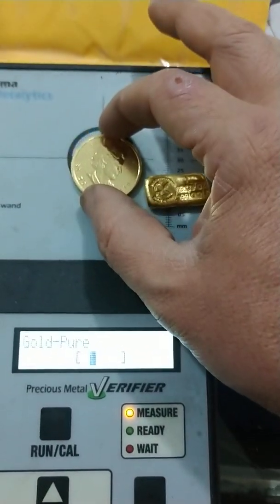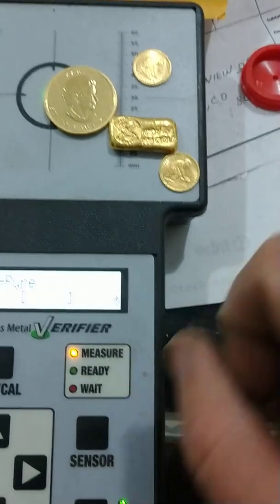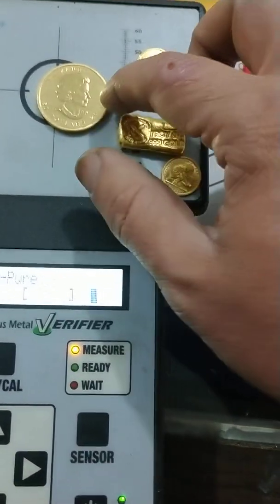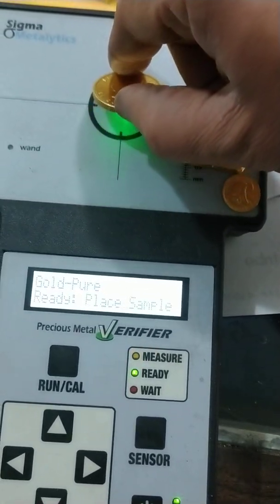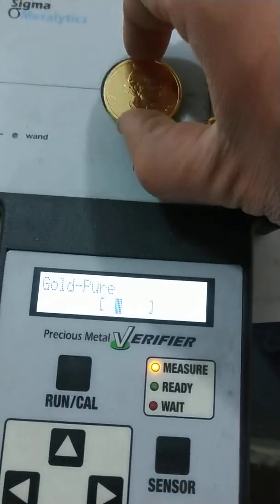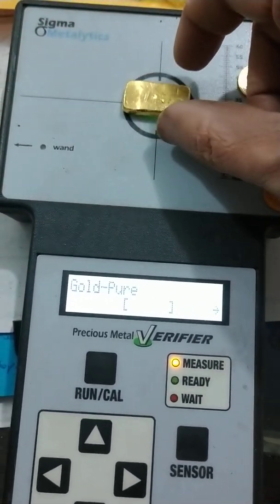Here's what a lot of people don't understand: when you move the item around, the reading also moves. Notice when it comes in contact with other gold, it also moves. This means that shape has a determining factor. Position has a determining factor. When you lift it up, it changes based on the shape and angle of the gold. So it makes absolute sense that if the item is not the standard shape the machine is calibrated for, it's going to have some kind of an issue.